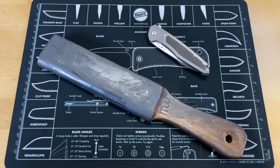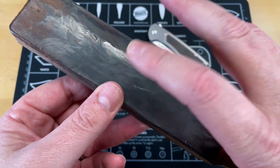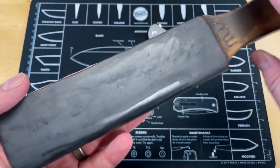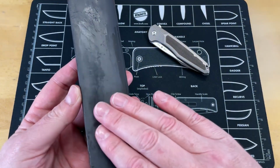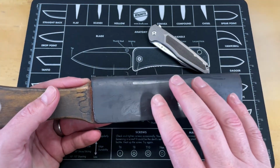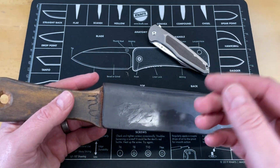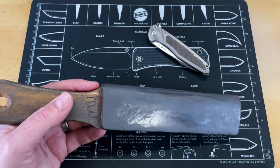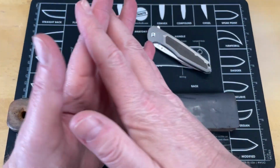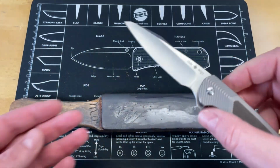Now, first things first, I'm going to tell you, if you use a loaded strop, now this side has got chromium oxide on this because some steels do really well with chromium, and this side has got a diamond emulsion on it. You can actually overstrop knives with this because they are abrasive. I'm just going to give you a warning. Putting an abrasive paste on here can actually detract from what you're trying to do, and you lose the tooth on your knife because this is 1 micron. Not all knives are going to deal well with that, and it's going to burnish your edge, which means that the little micro serrations that you've established by sharpening it can actually get removed.